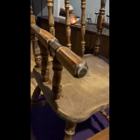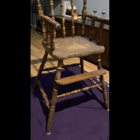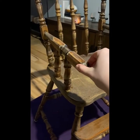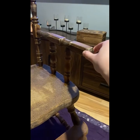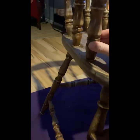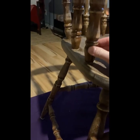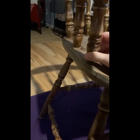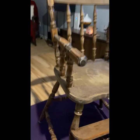The only kind of damage on this piece was that one of the armrests was a little bit wobbly — you can see here compared to the other one, it was just a little bit looser. So I did go through off camera and put some Gorilla Glue into the base of those spindles because they could move up a bit, and that perfectly solved the problem. Luckily that was the only thing I had to repair on this piece, which is always a plus.